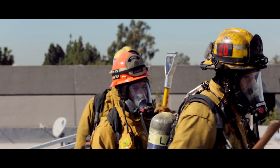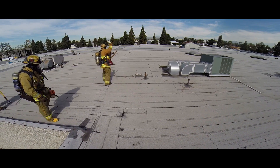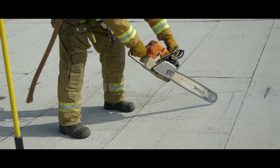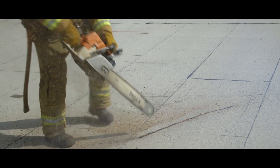If the sounder feels a member every 8 feet, then the purlin direction has been exposed. If a greater distance between members is felt by sounding, then beam direction has been exposed. An inspection cut is vital for member direction, construction type, and most importantly, safety.